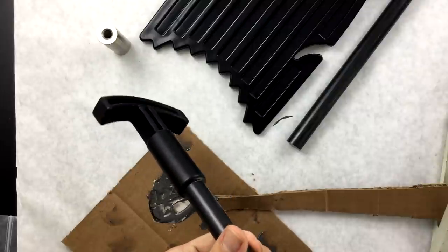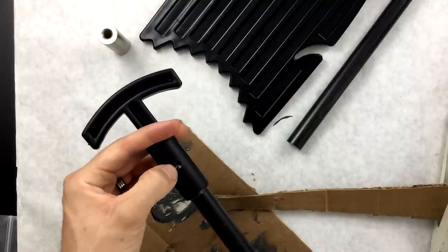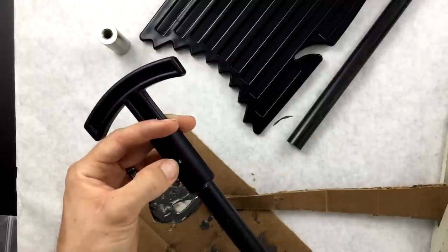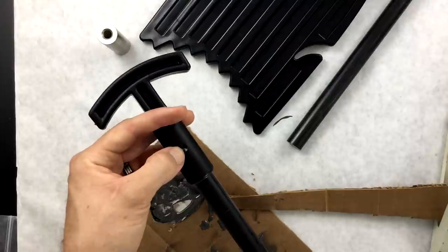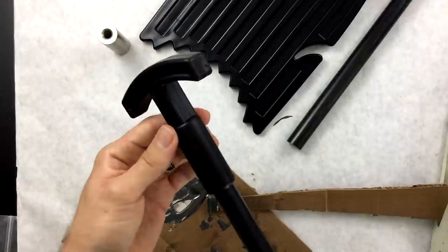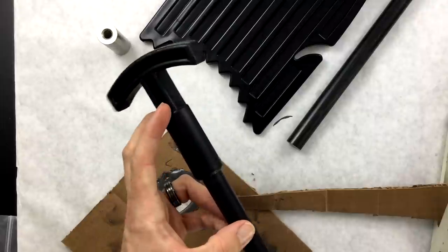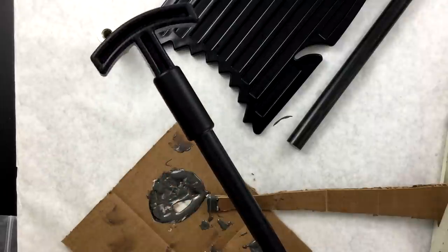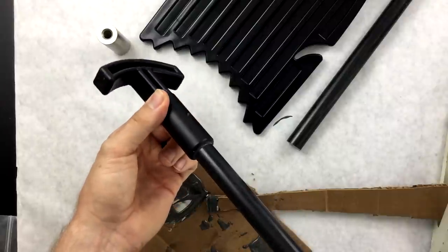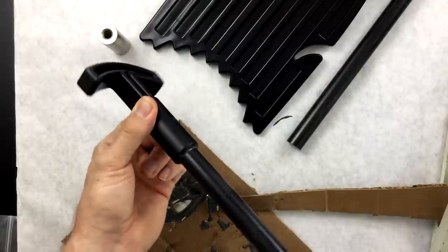There's a good-looking T-grip piece all set up. Now go ahead and pilot hole drill this right here with at least maybe a 3/32-inch drill bit — I wouldn't go any bigger than probably 1/8-inch drill bit. Then you can get a good small-diameter stainless steel screw, or you could use a rivet through there, or even a very small epoxy-coated screw. In most 99.9% of cases, the glue and the adhesive is all you're going to need.